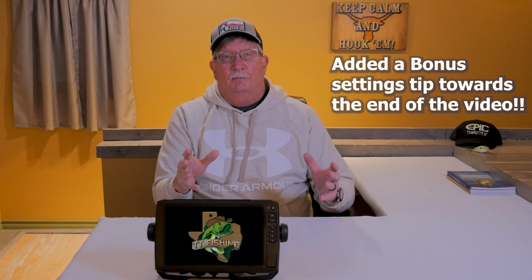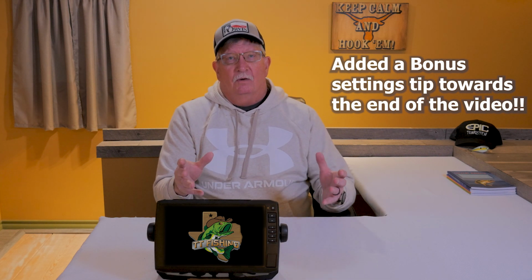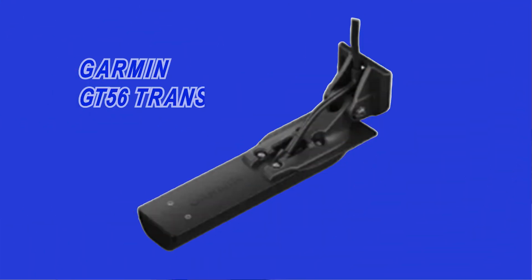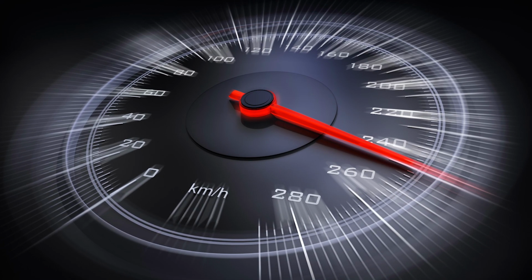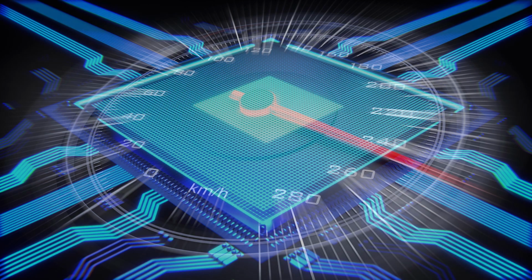Now let's talk a little bit about why the units are getting so hot. Well, with all the latest technology, you've got transducers that are drawing more power. The GT54, when they originally came out, were 350 watts. The new GT56s are 500 watts, and other manufacturers even go higher than that. So you've got the transducer drawing more power, and more processing power and speed. If you know anything about computers and graphics, those processors generate a ton of heat.